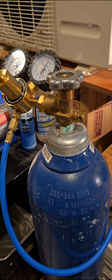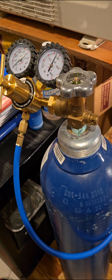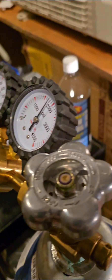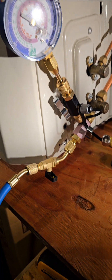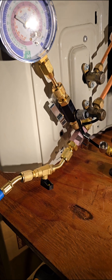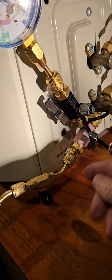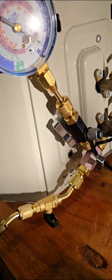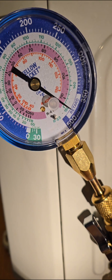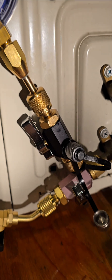Here's a better view of the nitrogen tank valves — nothing to be scared of, it's just nitrogen in a tank and you control all the pressure with that valve. You hook it up to your valve core removal tool — that system is perfect for this, it's all totally contained. I already have 450 pounds in there for 48 hours, so I know for sure nothing is leaking on this system.